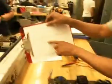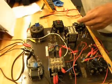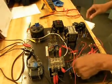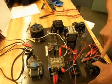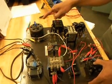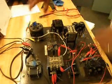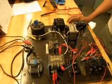Either of the other two positions will cause it to jog because it will be bypassing the holding contact. So it's now in a different position — it will only stay on as long as I'm holding the button. That's how we move it in small increments to make adjustments to the machine for whatever reason we might want to do that.